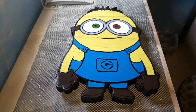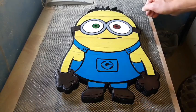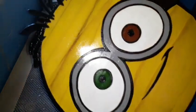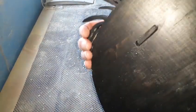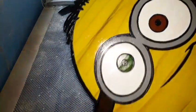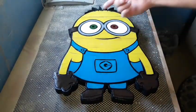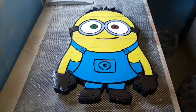Right, that's it — this little project is finished. We've given Bob three or four coats of the yacht varnish just to shine him up a little bit. It's an indoor piece so we don't have to go too crazy. And you can see from that it's got a nice finish to it — I'm happy enough with that one. It's a good inch and a quarter thick, so for hanging purposes, basically just route out a nice slit in the back — that's more than enough for hanging. I like the watered-down acrylic paint effect — it just lets you see the grain of the wood coming through. So that's it, he's finished: a 20-inch by 14-inch Bob the Minion, routed out and scroll sawed out with a Pegas V spiral blade on recycled pine. Thank you very much for watching.